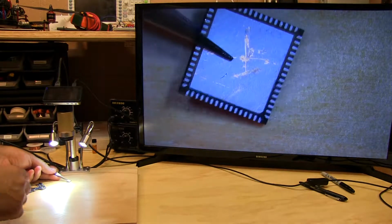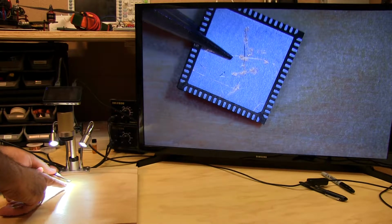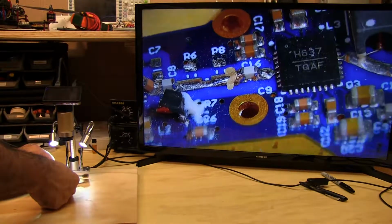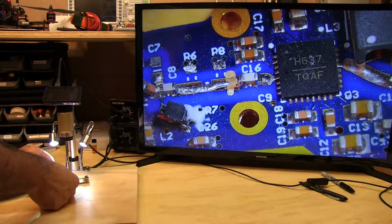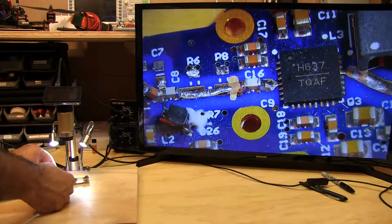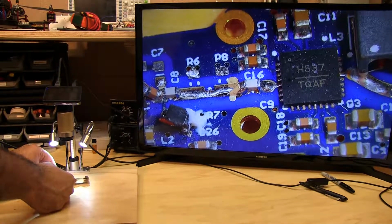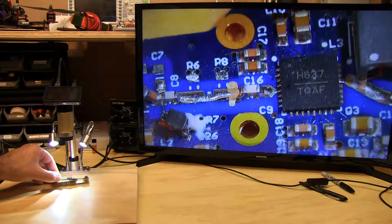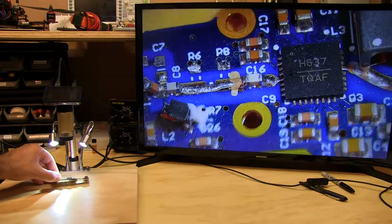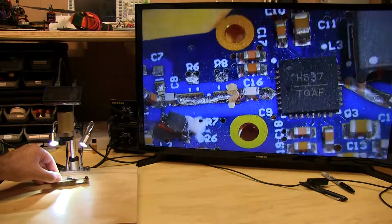What they really want is a good solid solder connection to be made to all the bottom leads. But it helps because the presence of a fillet there, as I showed before, will give you a good idea that the part's been soldered correctly. Of course, you can't prove that without an X-ray, but if you're hand soldering this or just prototyping, for the most part this will work for what you have to do.